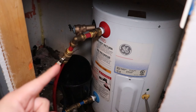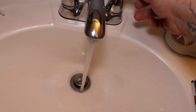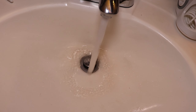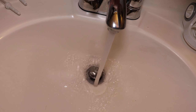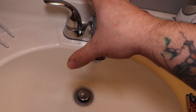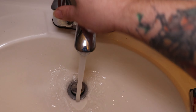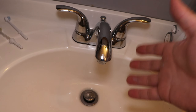And last thing before my battery dies — once the pressures are completely open, go over to your closest fixture and your furthest fixtures and make sure there's no air in the system. It is better for the purges of air to come out through your faucet than for them to bring all that force to your tank. It's safer here. Go to your shower, your toilet, your tank — make sure everything else has received pressure as well, because there will still be residual air in your plumbing.